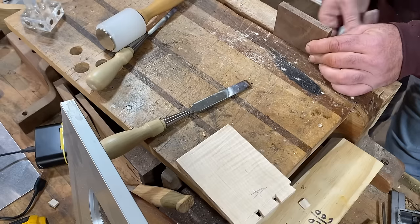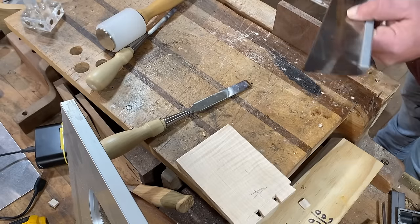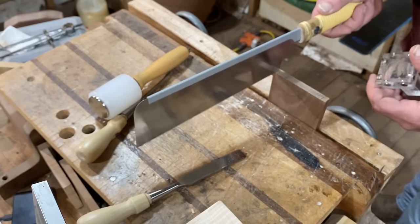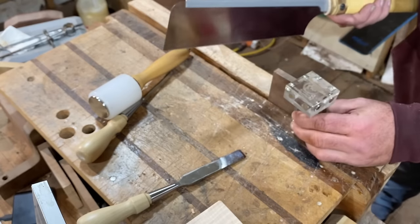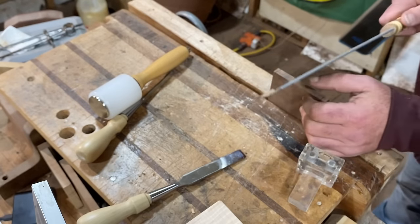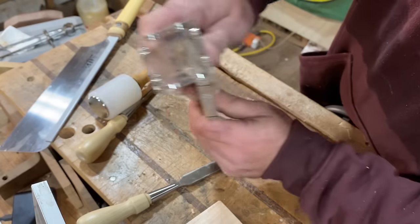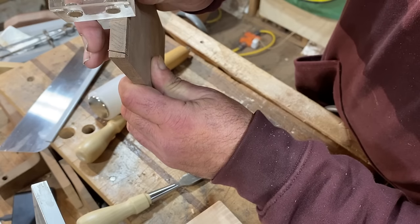I like to start with the back of the pin board facing me. Set the right side of the saw — these teeth right here — right up against that knife mark, and just pull your saw back one time. Now that we made a little kerf, set your saw right in that kerf. This is where we'll use the pins on the jig. Line up the pin on the right side and make this cut — just go straight down to your line, don't go past it, and just repeat these steps. Then we'll spin our board and use the opposite side of the pins. You can see when we set our jig on the pin board it lines right up with our mark at the same angle — that's the beauty of this jig.